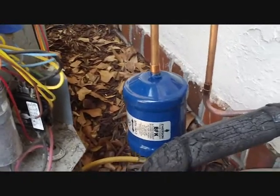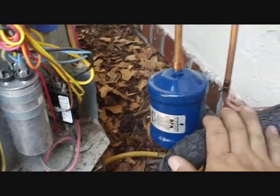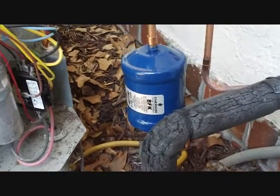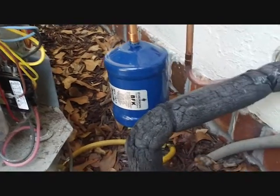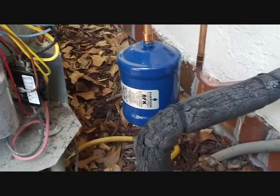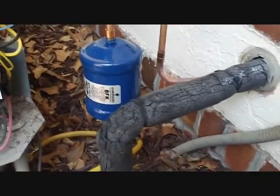Outside we've got a Uni-brand biflow filter dryer, because we've opened up the refrigerant system, and I like to always install a new dryer afterwards. What I did was I put the bends in the pipe coming out of here so I keep it upright. I like to keep them upright because they perform a little bit better as far as fill — especially if there's a low charge or something like that. The dryer is always utilized 100% that way. We're going to braze this up, then pressure check with nitrogen, and hopefully it'll hold and we can put it in a vacuum.